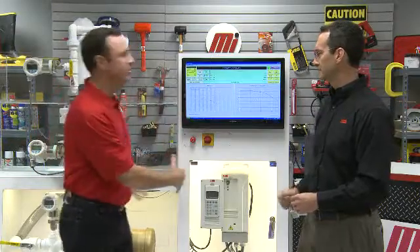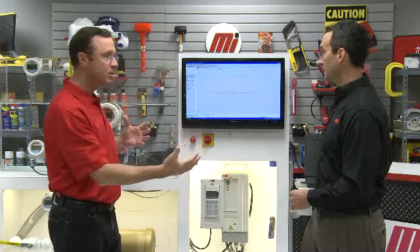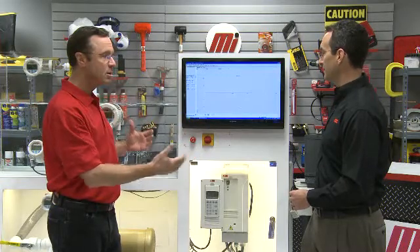This demo is very small, but will this work for larger motors? Yes it will. As a matter of fact, the higher you are in horsepower, the quicker your payback will be. A larger horsepower motor will consume more energy and require more dollars to operate per year. So when you reduce the speed, your savings will be that much more and your typical payback is far less time than with a small horsepower motor.